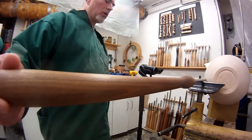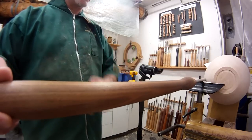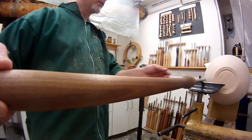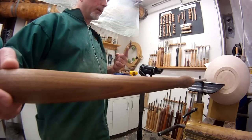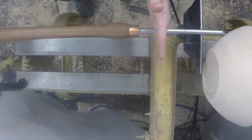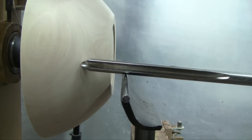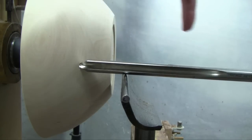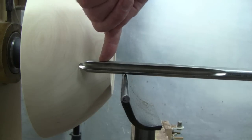So what is the criteria for how long a tool handle needs to be? There is some secondary criteria - obviously if the handle is too long and too heavy that's no longer practical, and there are situations where a long handle can actually get in the way. But as far as primary criteria, there's really only one thing that's important: I need to have enough leverage on the handle side of the tool rest to be able to control the tool. Anytime I take a tool to a moving piece of wood there's going to be some downward pressure on that cutting edge, and I need enough leverage on the handle side to control any downward force on the work side.